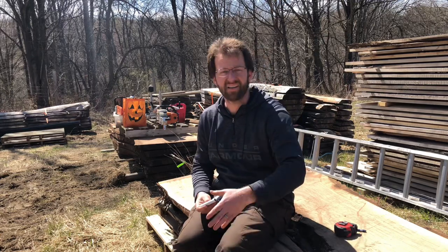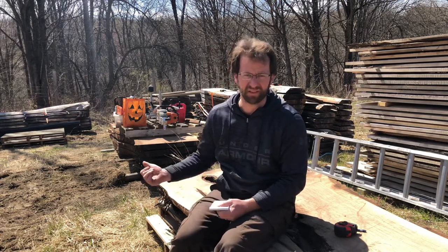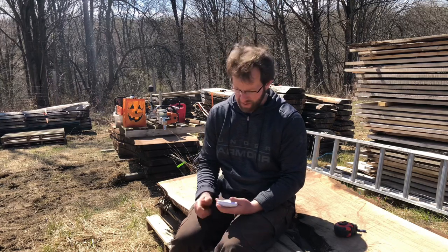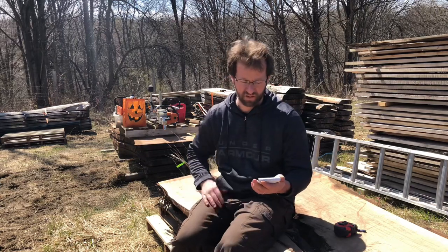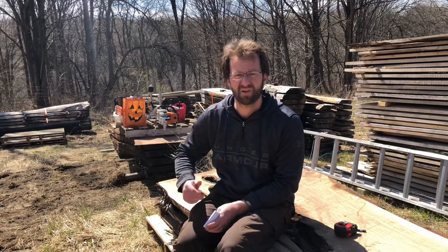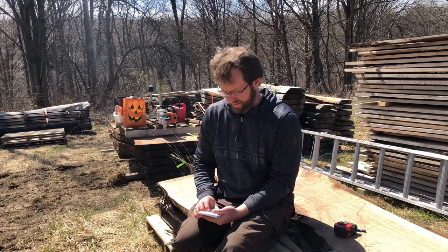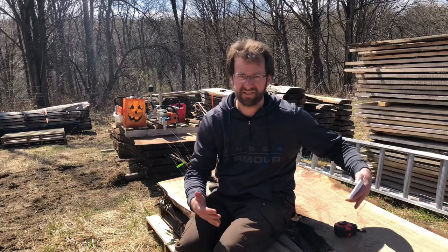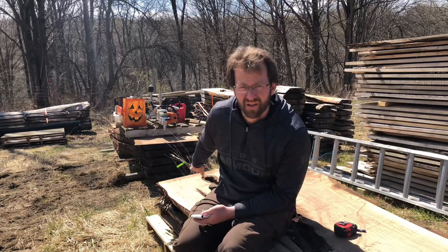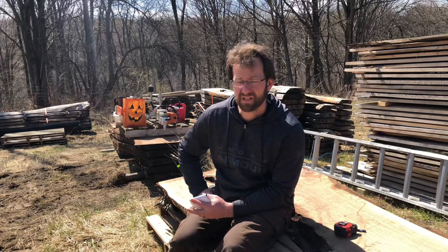So that's that. A few statistics in case you were thinking that milling your own lumber with an Alaskan mill is something that you wanted to get into. Things that I was not aware of. The first cut, which was pretty small width-wise, took about 10 minutes. So over a 10-foot log, that's 1 foot per minute. As I got wider and ultimately to the max width cut, so anything from about 36 inches to 42 inches up at the crotch end, was taking me about 30 minutes, so 3 minutes per foot.